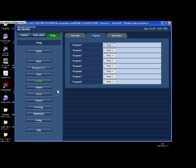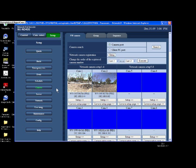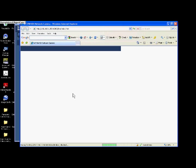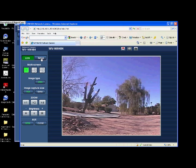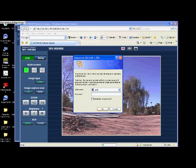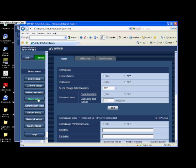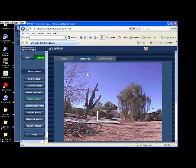The recorder is now set up — it's accepting alarms and we've told it to record 10 seconds before and after the event with no audio. Now we go to the camera, because we have to actually tell the camera to send us the motion detection alarm. I'm going to camera number three — the one we set up in our schedule. Now we're at the actual camera menu. Going into the setup menu, then to Alarm Setup, and the first thing I want to do is turn on the VMD alarm.